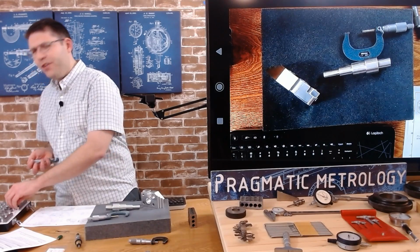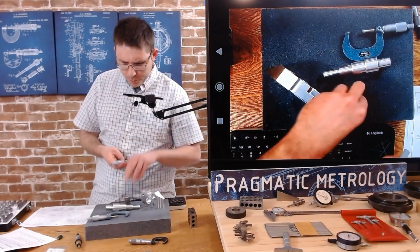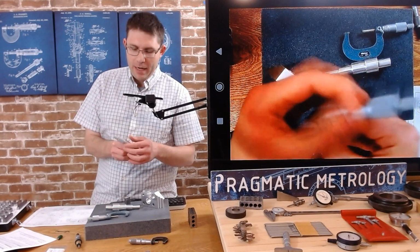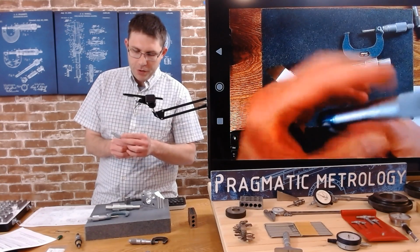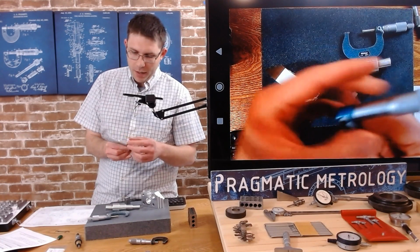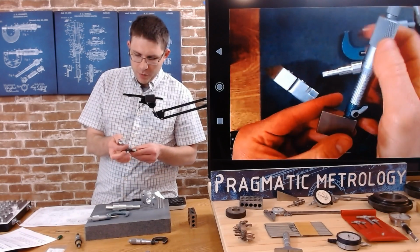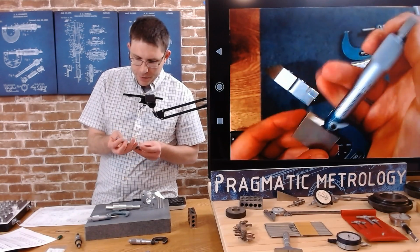That's a little concerning, but we'll go ahead and check the full stroke again. It just means there's a little bit of error at the half-inch mark, and there may be error in other places. If you're concerned about that, check more of these blocks. I'm a little concerned. I'm going to check 1 inch, and we're going to see how it finishes its stroke.